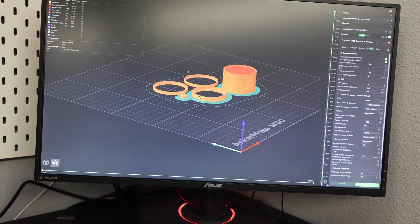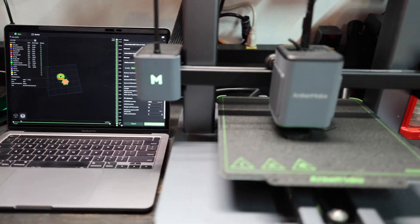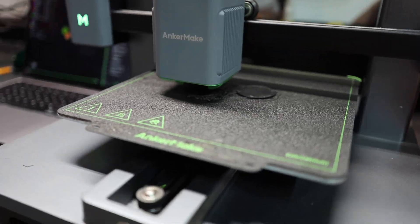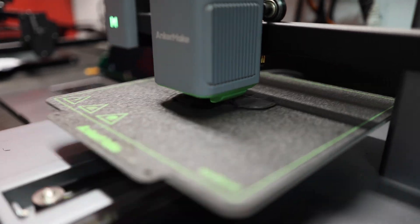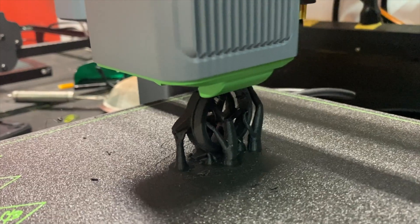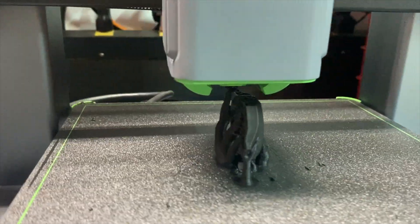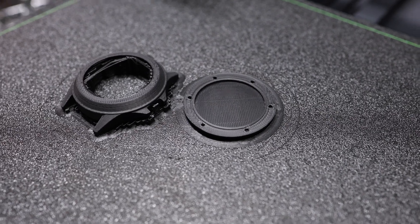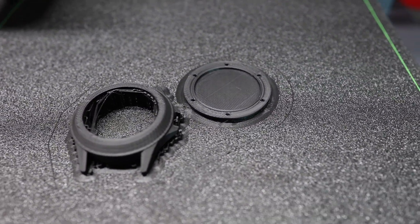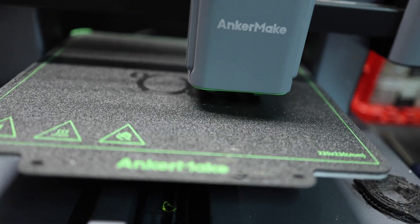There is a fee for the files — seven dollars US — and James did provide me with a discount code. This is not an affiliate code; I don't get any kickbacks. I messed around a lot with printer settings and orientations, and the best orientation I found was printing dial side down for the case, using optimized print settings for everything else at the finest resolution I could. James has much more in-depth instructions included with the downloads and step-by-step tutorials on his YouTube page.